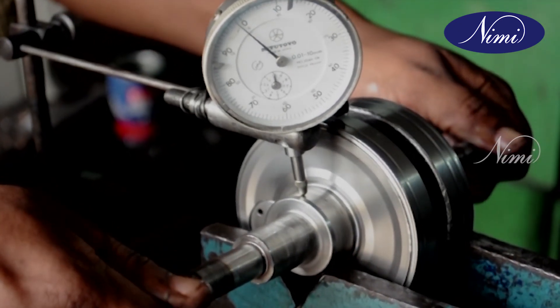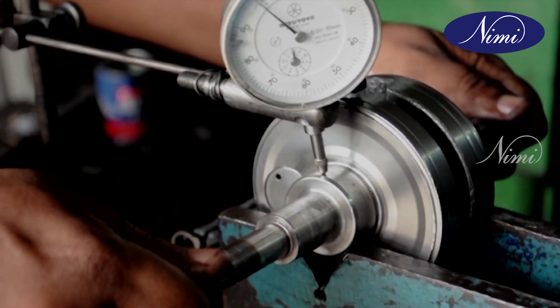The various other applications of dial gauge are shown. Hello viewers. In this exercise you have learnt how to measure the dimension of a component using inside micrometer, measure the dimension of a component using outside micrometer, and measure the flatness, straightness and ovality of the surface using a dial gauge.